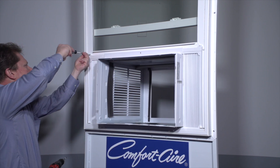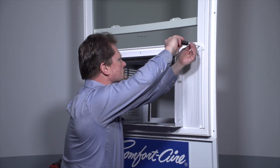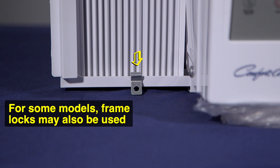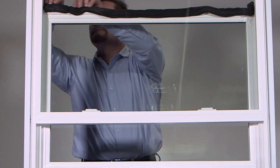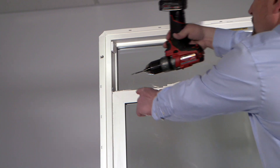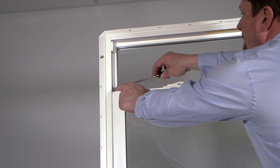For some models, clips may also be used. Install the installation screws with your Phillips screwdriver. In order to install the frame lock on the edge of the accordion, drill a pilot hole as needed and install the screw. Repeat on the opposite side as needed. Cut the foam filler tape to length and install it between the panes. Install the sash lock at the top of the window by securing it in place with two half-inch screws.